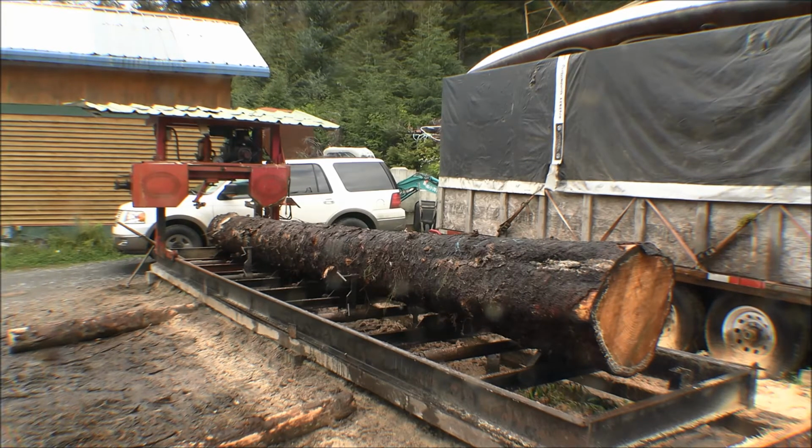This end of it here is actually up and down. The way it's sitting now vertically is 26 inches, but it's got a pretty good groundswell in it, and by the time you get back down to that first cross member there, it's 23 inches. Then it tapers down quite a bit from there. Big bell, big groundswell. I figured 23 inches, the other end 17 inches, so that would be 6 inches total, which means I should bring that other end up 3 inches to split the difference, so I'm running parallel with the heart so the grain doesn't run out.